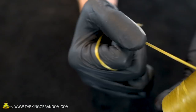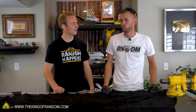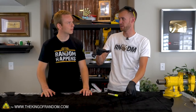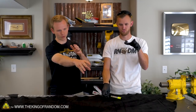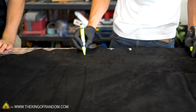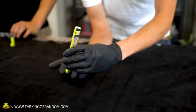The first step is to measure out exactly what we want the bellows to look like, and that's going to be dependent on how much leather we have. We're going to do four side panels and two bottom panels. The goal is to make two bellows, because that way as you're pumping air, you can always have one pushing air in while the other one is refilling. It regulates the airflow and also prevents air from the bellows from sucking air in from the fire, which would burn it and cause problems. We're going to use this very authentic primitive technology chalk marker. We want them about one cubit long — a cubit being the distance from your elbow to the tips of your fingers — and not quite a cubit tall. Very precise caveman-style measuring.